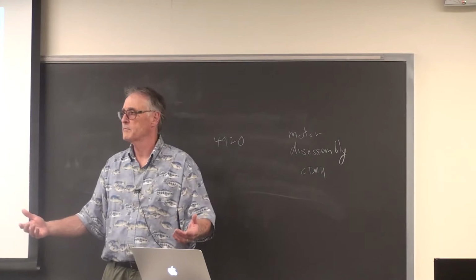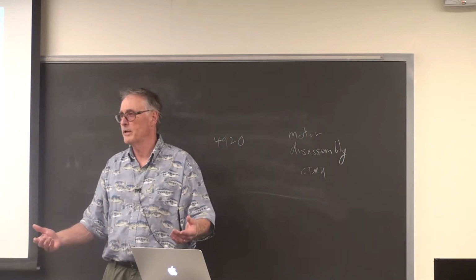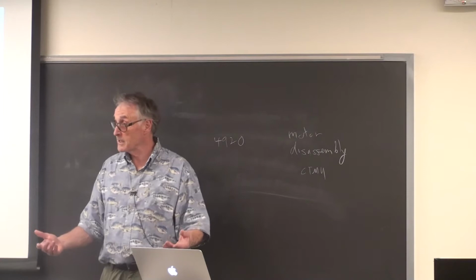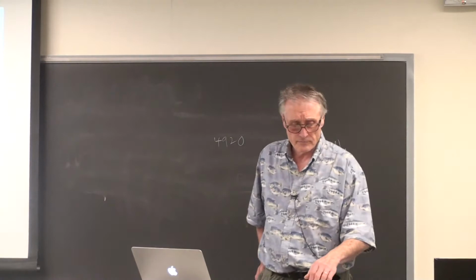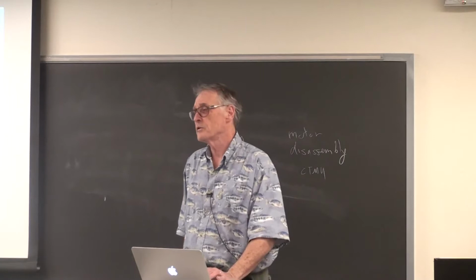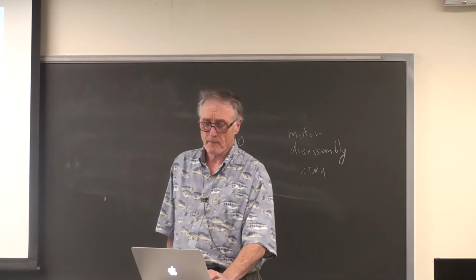So one way to do that is, of course, just toggle an I/O pin in the interrupt. See how fast it toggles. If it's toggling at 500 hertz, it's missing every other interrupt. If it's toggling at a kilohertz, you're making the deadline. There's better ways to do it too. You can read timers. Anything else on Lab 4?